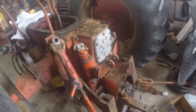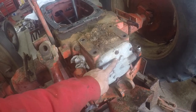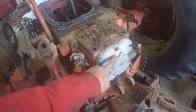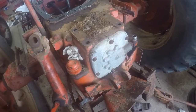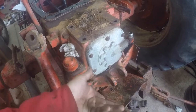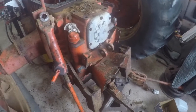The thing about hydraulic pumps is the clearances in there are very, very tight — and they have to be to create the pressure they make. When they get a little wear and some scoring, the pressure just slips by and the pump's no good anymore. Rust is the same as scoring because it leaves pits where you have to have a seal.